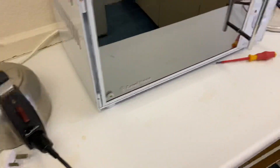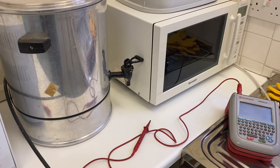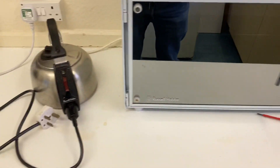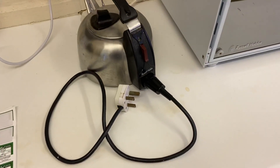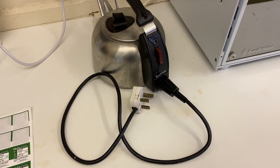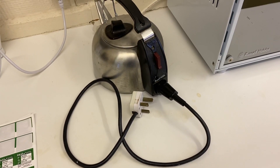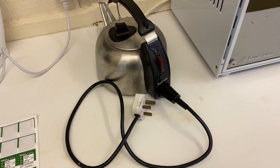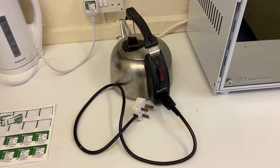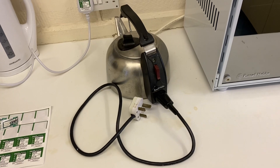But where possible you want to try and change the plug to a new plug with the sleeved pin straight away. Like all PAT test jobs, I come across stuff every day that surprises you — you think, oh I haven't got enough plugs for all of that. You just have to react, do the best and safest thing on the day, keep notes and records of everything you're intending to do, then get the plugs swapped out for your customer to make them nice and safe. Don't forget to like and subscribe to the channel — I hope you got something from this and I'll see you all soon.